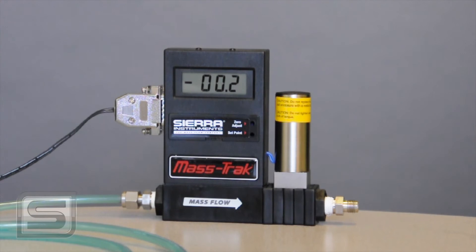Use the listed pressures and gas for best operation. Like I told you, if your label tells you we've calibrated it for 50 psi inlet pressure and maybe 5 or 10 psi outlet pressure, try to use it in those ranges — that's where you'll get your best operation.